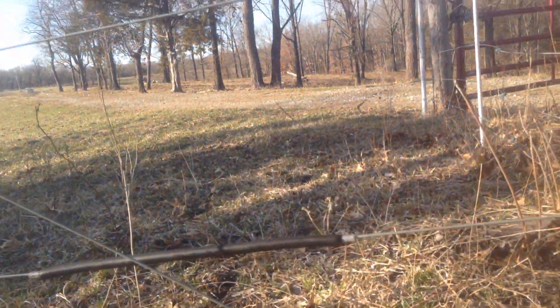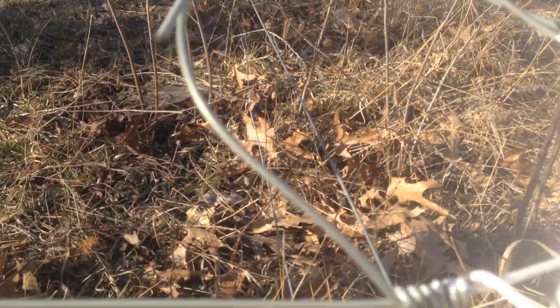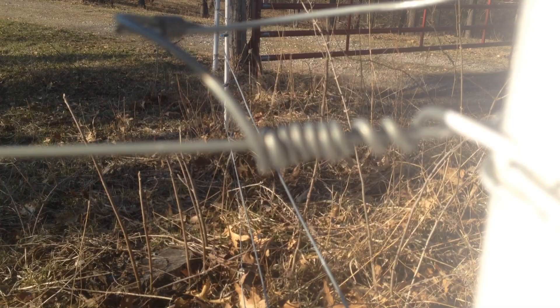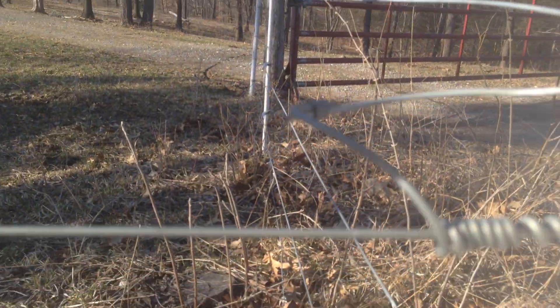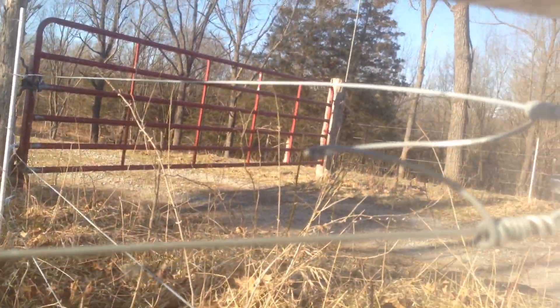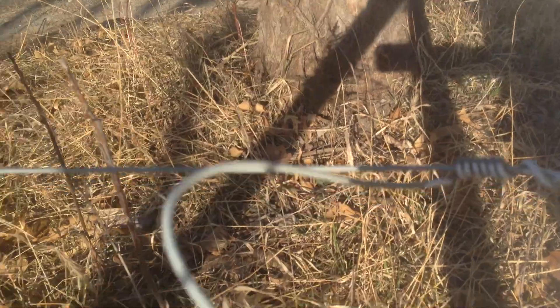When you put five wires on there, you comb around your post. You just wrap it here on the ends — that's what we do. And then we put our — that's called the hangman's noose knot, we just wrap it. That saves the crimp. And then it's tied on right there — see there's a wire going back to the gate over there. Each one of those is tied on. See that? It's got a crimp there. So when you get to your corners, you just crimp each respective corner to the other wire and that continues your power on around the farm.